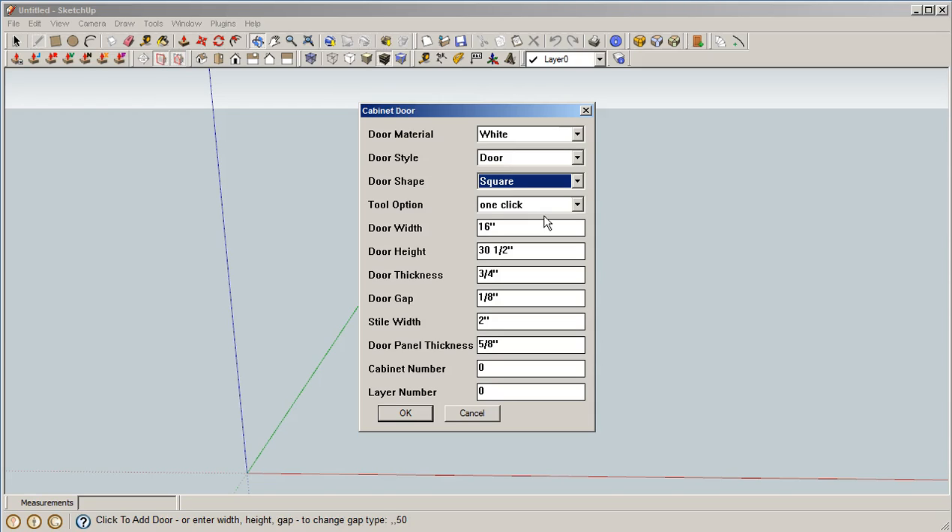It's going to be 30 inches wide by 80 inches high by 1.5 inches thick. For the bottom panel we're going to go with a 30-inch height — a 20-inch panel plus 5 inches for the stiles and rails. The door panel thickness is 1 and 3/8 inches thick, and the complete door thickness is 1 and 1/2 inches thick.